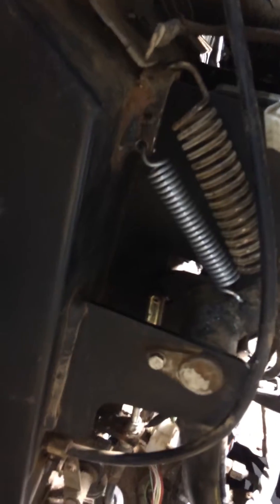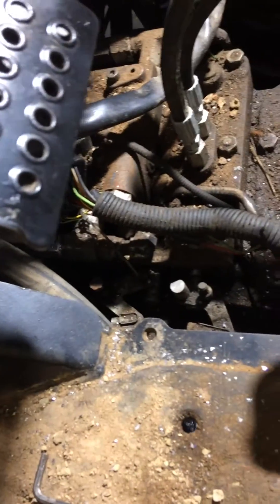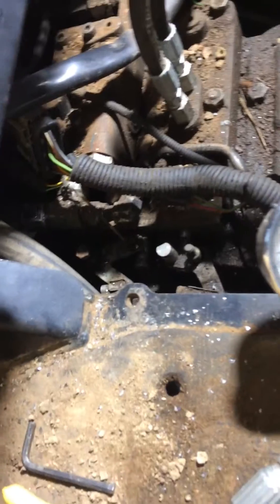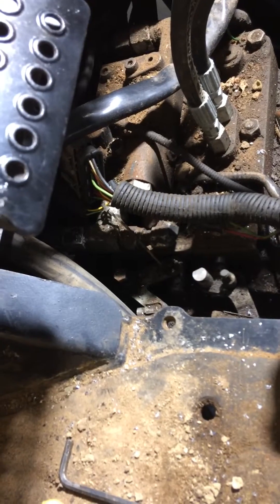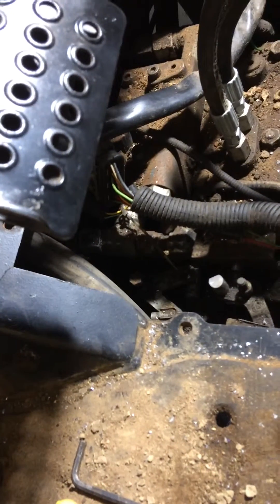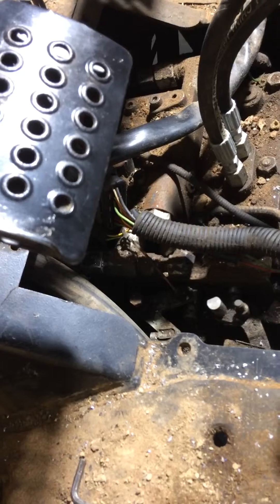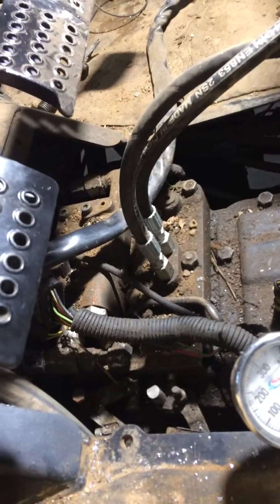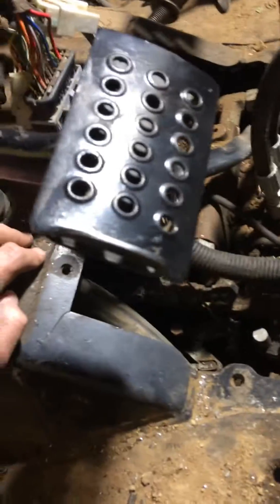Just a simple tension spring - I had to drill a new hole in the bracket and a hole down here. It feels so much stiffer now. I'm curious to drive it and see if it makes that much of a difference as far as the pressure to engage or disengage the clutch when I depress the pedal. I think it's worth it though, because if that pedal is down even just the slightest - it was barely perceivable how much I had to pull it up to make the pressure jump back - you can save yourself a lot of trouble with these transmissions by making sure the clutch pedal is returning properly, instead of having to split the tractor and put in new clutches. Hope I helped someone - email with any questions, thanks.